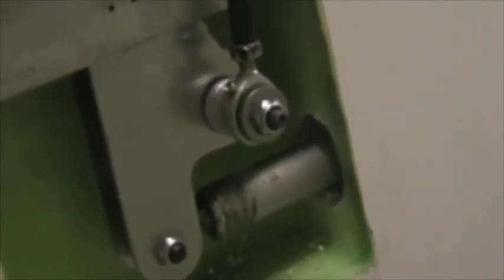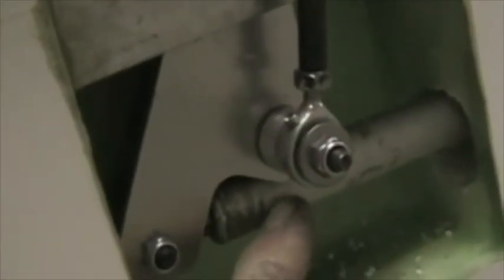The aileron bell crank assembly is now complete, and we've got 90 millimeters up travel and 45 millimeters down travel, and that occurs as the bell crank hits the two stops, this being the one stop. When the top of the pushrod tube contacts the 12 millimeter spacer, and the other stop is when the bell crank contacts the actual aluminium extrusion up there.